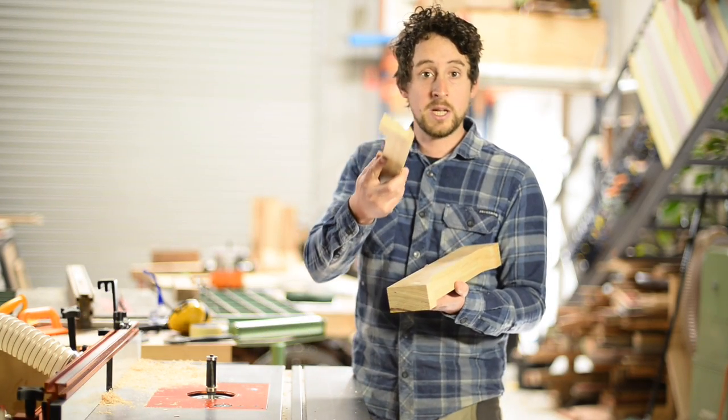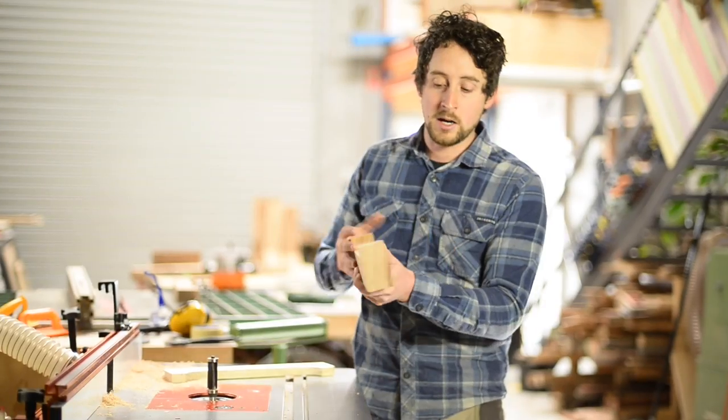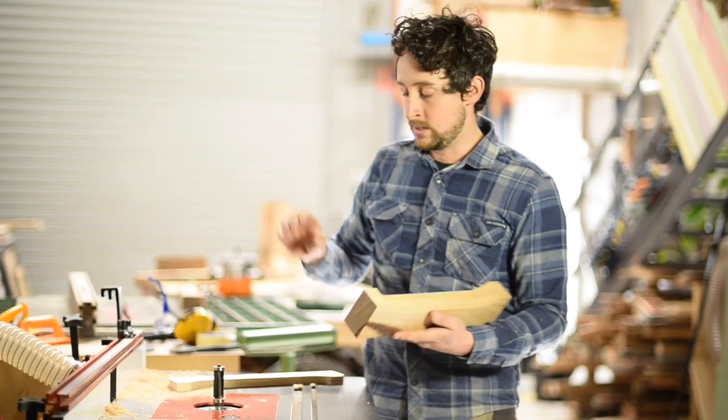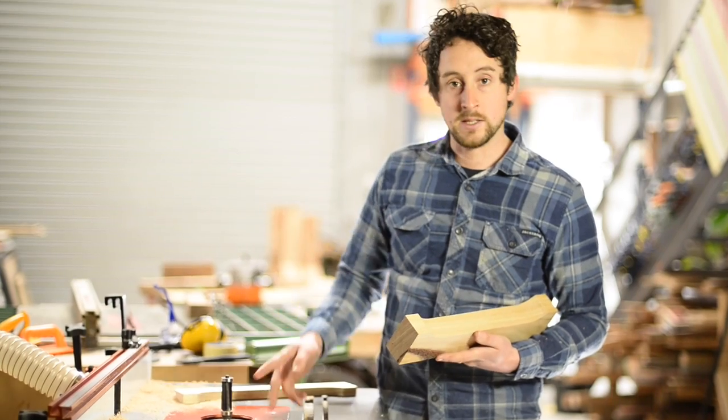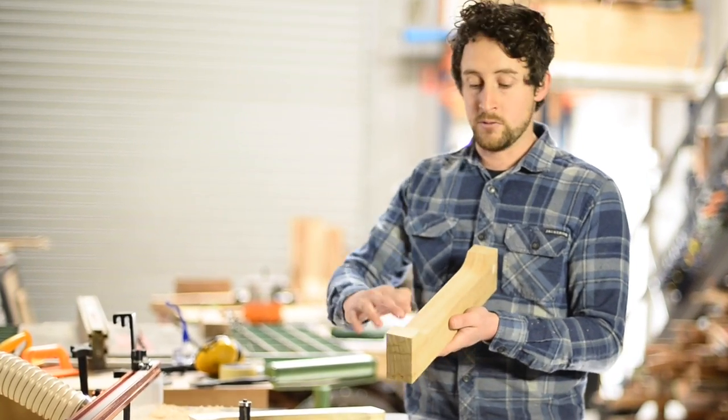I've knocked off the template and it's ready to use on the next piece. I've got really nice clean faces, even though we've essentially done two end-grain cuts and what would have been against the grain. That flipping-over method is one of the really great reasons to have two bearings on a bit this size - you just wouldn't be able to get results this good any other way. There are obviously many more ways that these can be used; I just wanted to show you a few of the ways I commonly use flush trimming bits and why you need the different sizes.